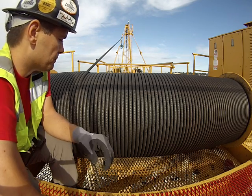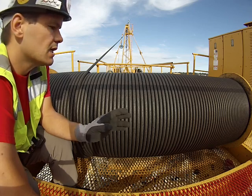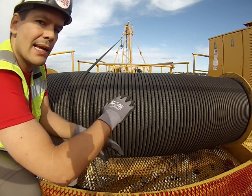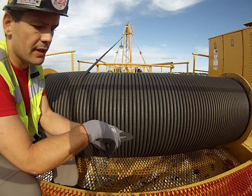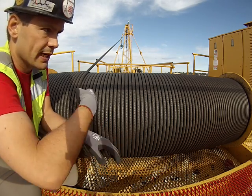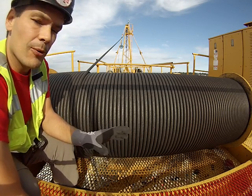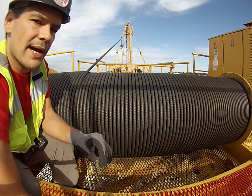This is where you do the cursory visual inspection. Make sure the rope is laying nicely — no holes or big spaces between wraps. If rope sinks in between layers and comes out, it pops hard and causes early wear. You'll want to re-spool it: take all the rope off the drum and have somebody guide it back in place. Make sure that's a technician or ironworker who deals with cranes, not just anybody, because they can get themselves in a bad spot.